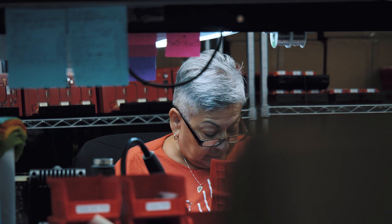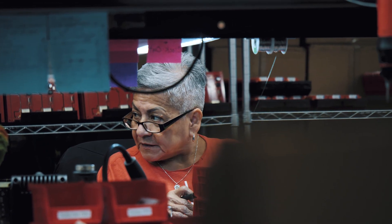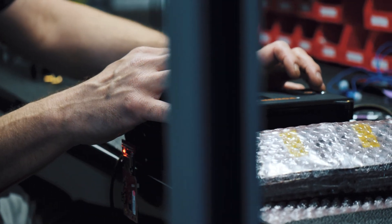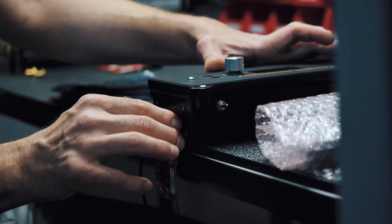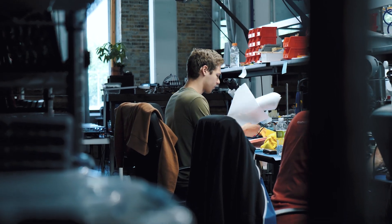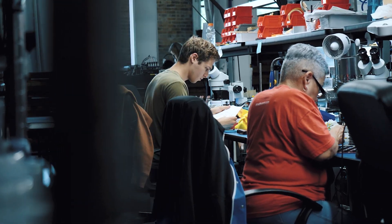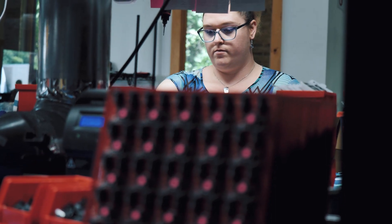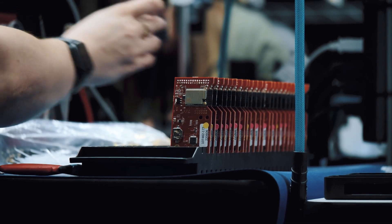To ensure that quality is maintained on the production floor, we have tracking sheets that move with every rack. The next station's job is to perform an inspection on what the previous station did — so from soldering moving into the flashing station, flashing techs are required to inspect all the soldering work; the conformal coating station inspects all the potting work. Every station that the boards move to, there is an inspection done by that next person. It's the little details — you see something you've seen thousands of times and it's just a tiny little thing that's different, but you notice it. That's what we do to ensure quality — we all work together to inspect each other's work and our own.